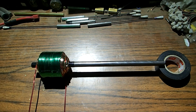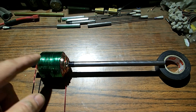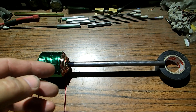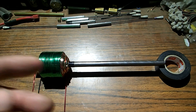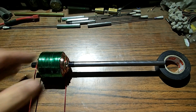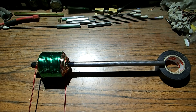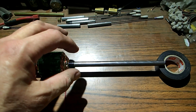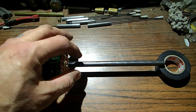The thing that I like about this design is that it only takes one coil to do the job, and if it has to be multiply pulsed then that's what's going to be the end run deal for it, because this is basically a transformer and once the coil reaches saturation there's no more inductance and there's no more transfer of power to the little bullet over here, which is a sleeve of copper,